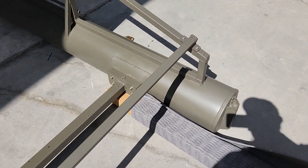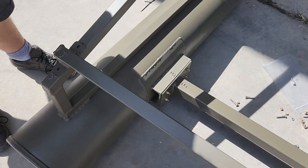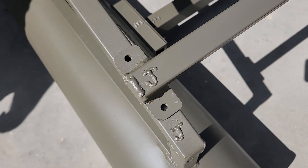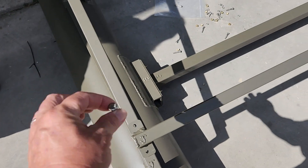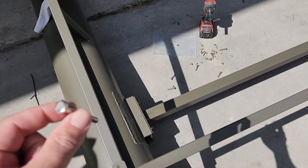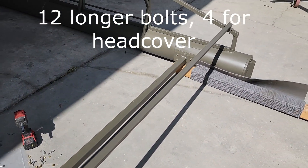On the next brace, we've got H to H lined up on that side and J to J on this side. One thing to keep in mind: when you get your bolt kit, there are some slightly longer bolts for these front two pieces because they go through a thicker piece of aluminum. Don't use your long bolts up top where you don't need them and then not have long enough bolts down here. Save your eight longest bolts for your two forward-most braces that go across the top.